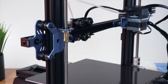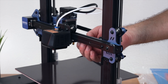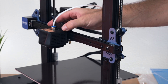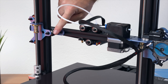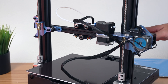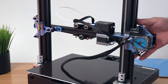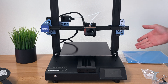We can also adjust the X-axis belt on the other end — on the right side looking from the front. There's a bolt that tightens and loosens it, and our belt here is way too tight, so we loosen it up. Moving the hot end back and forth, checking the belt is happy on the pulleys — perfect. For the Z-axis rollers, the stationary ones are outside and the adjustable is on the inside, but this is less critical since the Z-axis moves slowly. As long as nothing is too out of place or binding you should be fine; if it's close, don't mess with it.